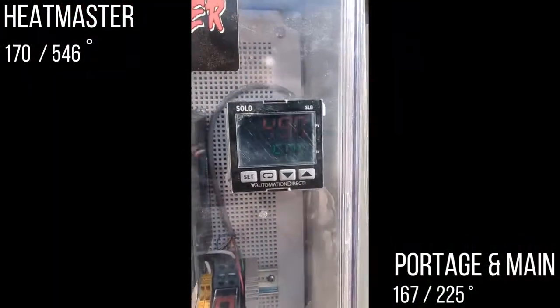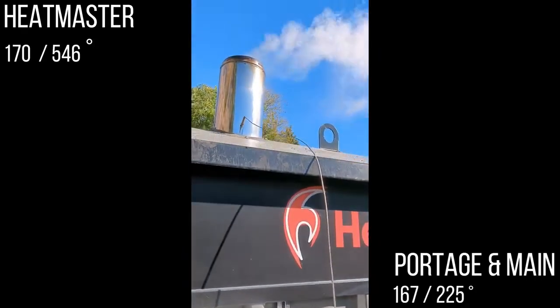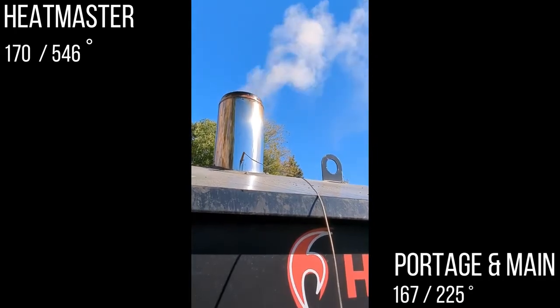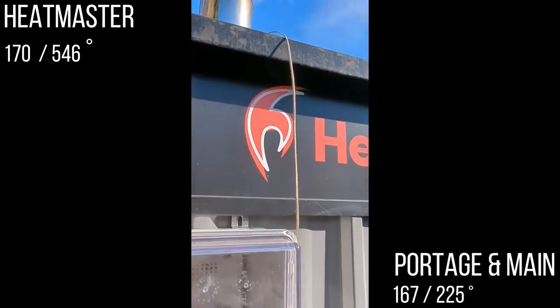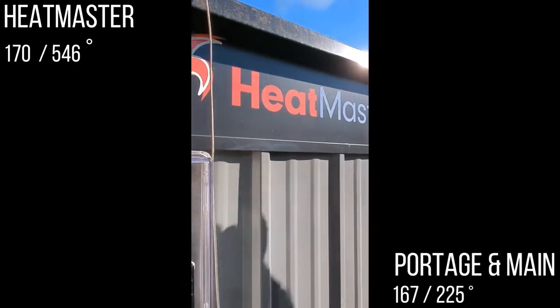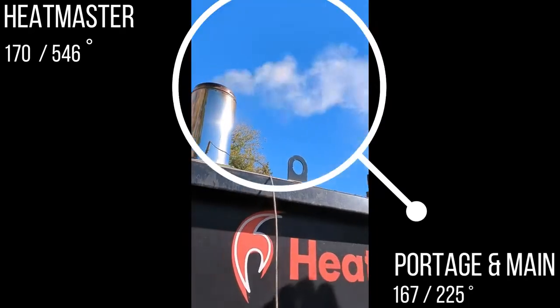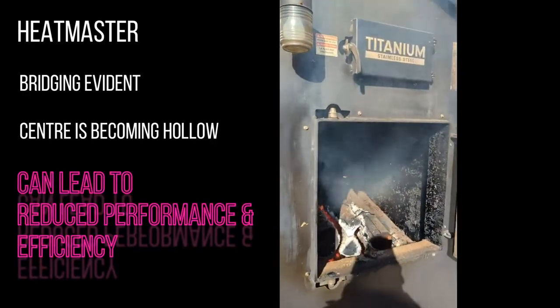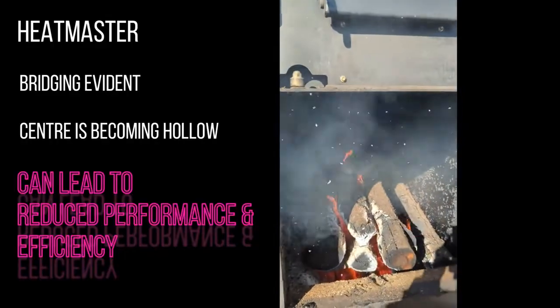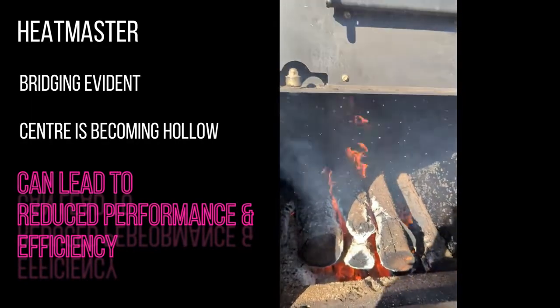This one's at 167 stack temperature and keeps rising. It's interesting to note that this one is rated at 375,000 BTUs and it couldn't overpower even a 150,000 BTU unit heater - like the shop unit heaters we're running. We're actually running two of them on it. You can see the smoke drifting out; it's going to evacuate the smoke out of the firebox. It's burning good.